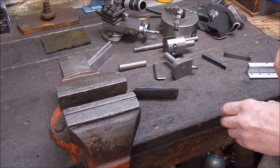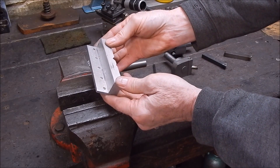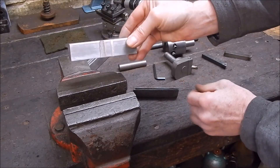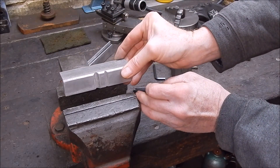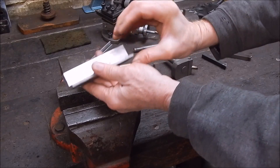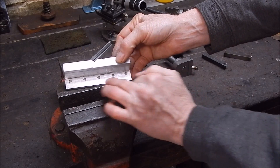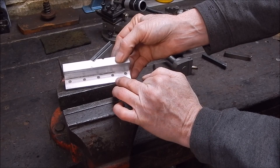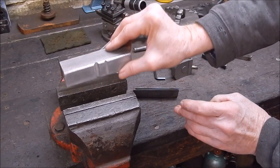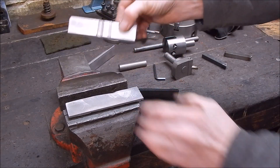The piece of aluminium I cast out of another two-piece mould is this one — this is going to be for one jaw. That will go on the inside like that. I've V-grooved it for round stock, going big to smaller. I've got a row of magnets in the back which I'm just letting dry — I've just got them araldited in — so these will have to stand for a few days to harden, and the cold weather will make that take quite a while. That jaw will basically drop in that way and then we just have one alloy jaw on the other side.